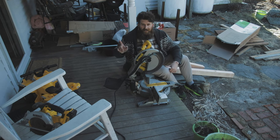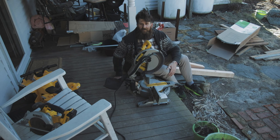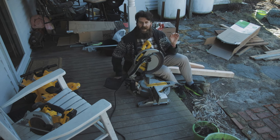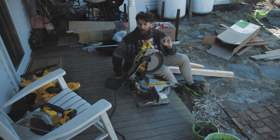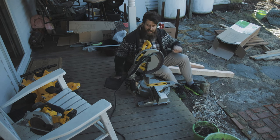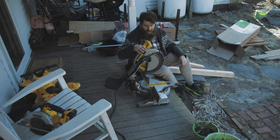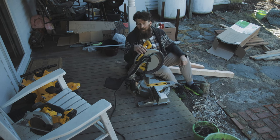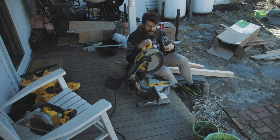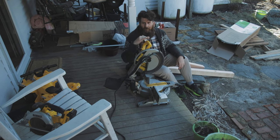So first major dilemma. For some reason my brain doesn't like to think of these things until it's already happened. A 6.5-inch saw blade on a circular saw means you can only cut through about 3.25 inches of wood, and that's just shy of cutting through a 4x4, which means I'm going to have to switch over to my miter saw here. I hate to keep throwing tools at you guys, but again, this is probably something you should have lying around for cutting thicker cuts of wood. This should be able to chop through no problem — I believe this is a 10- or 12-inch blade, so 4x4s are a piece of cake.